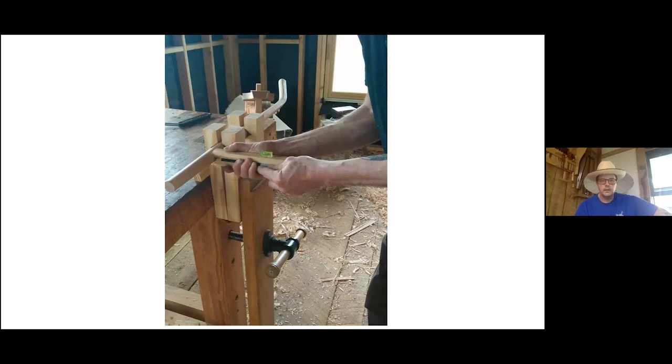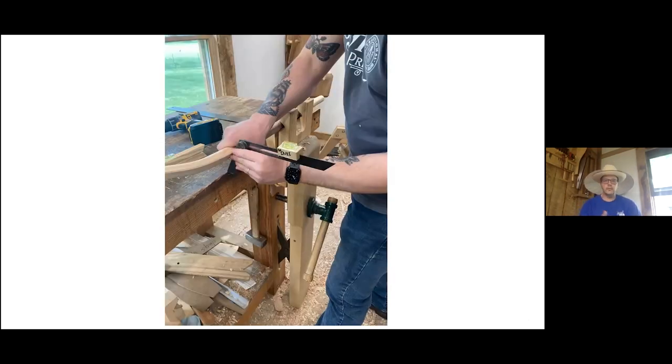That's a center finder to locate where you're going to drill in the center of the leg. Now you've found the angle from the seat, and if you level that post according to the angle you did the seat and drill it level to the earth, you should be able to get that first set of holes in the side of the seat that way.